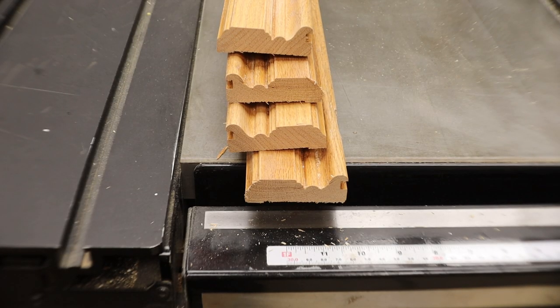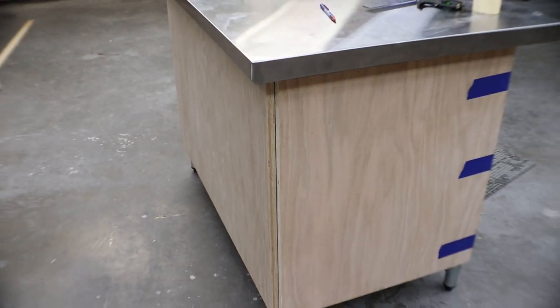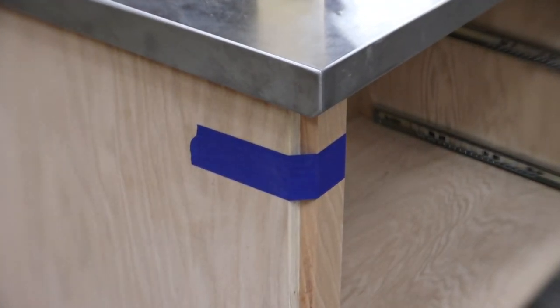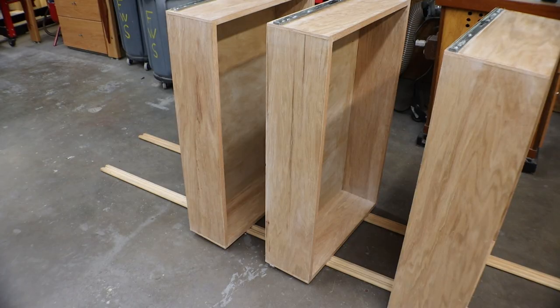Now I'm going to veneer the back. I have some leftover molding from a block paneling job in an office a few years back, so I'm going to use it up. I got the back veneer piece on in three-quarter inch red oak. On the very front, to cover up the legs, I veneered it again — this time with solid red oak. Since I could only nail it on the inner edge of the box, I put some two-part epoxy in there and nailed it to make sure it's nice and solid. Mr. Berto went ahead and put some sanding sealer on the drawer boxes — no gloss, just sanding sealer — and then sanded it.